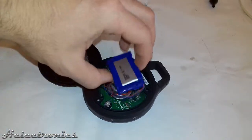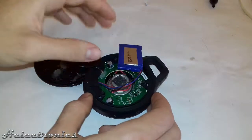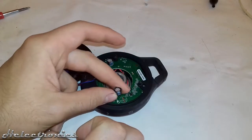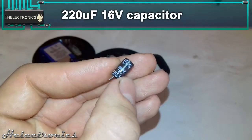The battery is usually attached with hot glue to the backplate. One of the capacitors has fallen down from the circuit, which I will have to solder back. This is the capacitor which came off the circuit — I will change it to a new capacitor which has the same values.